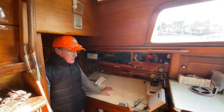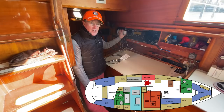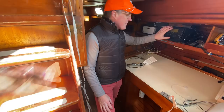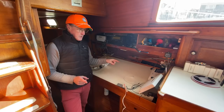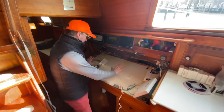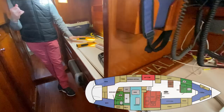At the nav station, it's pretty tidy. At first the radios didn't work — I couldn't quite figure out how to get them fired up for VHF. Something was disconnected, so I had to troubleshoot that and get the antennas going. I have a single sideband radio that turns on but the antenna is down in the bilge, so it's really not serving much purpose at this moment. On subsequent models, they turned the nav station sideways and angled it to buy a little more room and made this workbench longer.